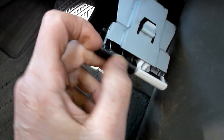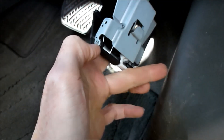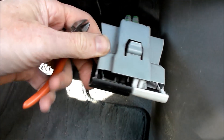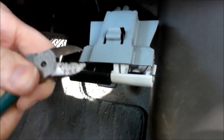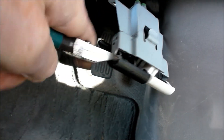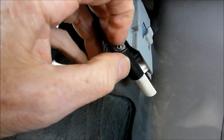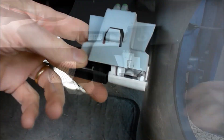In order to remove the steel pin, you need to squish this end. Normally it comes splayed out, which holds it in place, so you need to squish it. The way I squished it was to attack it with a pair of pliers and just squeeze it all the way around in order to scrunch it into a smaller diameter so that you can push that pin all the way out.